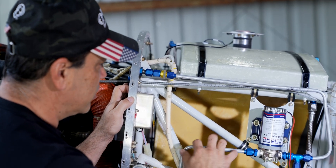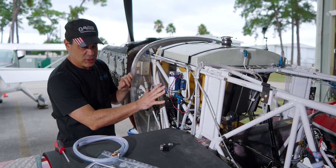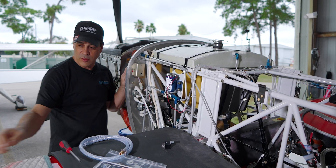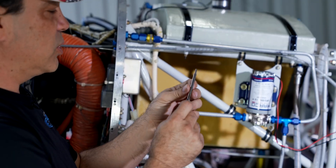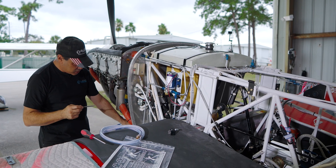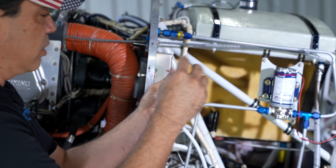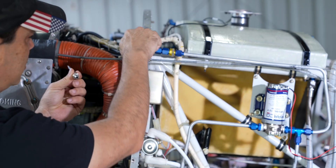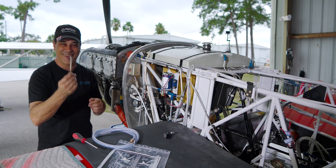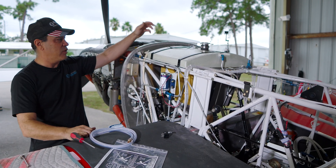So the oil goes through the check valve and then comes down the firewall to the exhaust. Here's the little injector tube going into the exhaust. Fortunately in this plane and in this performance exhaust they already had the threads welded in there, so this will go right into the exhaust tap. You can see what's happening: we're coming through this system, down this hose, into here, injecting the oil into the exhaust — and you have smoke. Warren's still finishing up the vents.